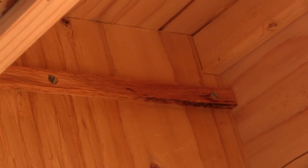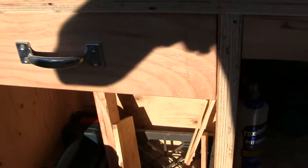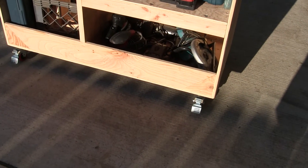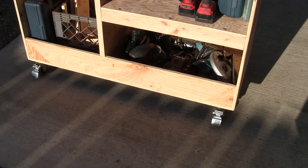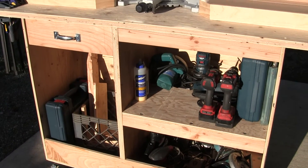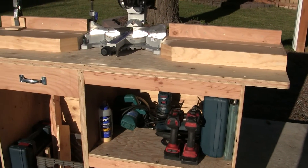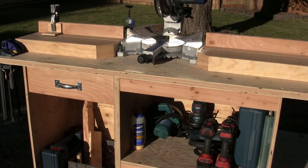The oak runner goes all the way to the back — I've got three screws and it's glued the full length, so it slides really nicely. I also put wheels on this: you simply unlock the wheels, roll it to where you need to go, then lock them into position — it's really sturdy. The total length of the top from left to right is 61 inches, and the total depth of the top is 19 inches.